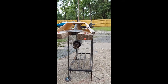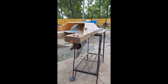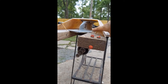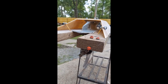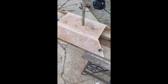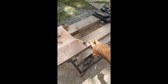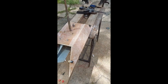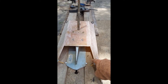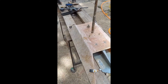This is my temporary jig to hold down the fiberglass panels to form the tunnel so I can tack it in place. From below this fin on down, it will be hanging out of the boat; this part goes inside the tunnel, recessed inside the hull. All this structure is just temporary to hold everything in place so I can tack it with fiberglass. Once that dries, I can build the other panels, tack them in, release it, and it should be ready to glass solid.